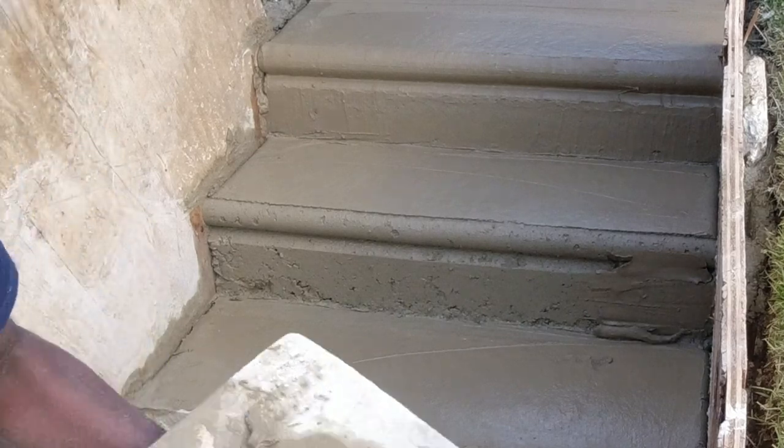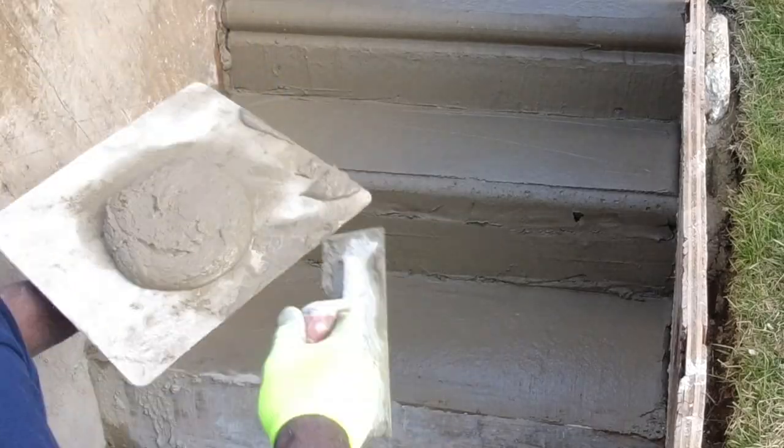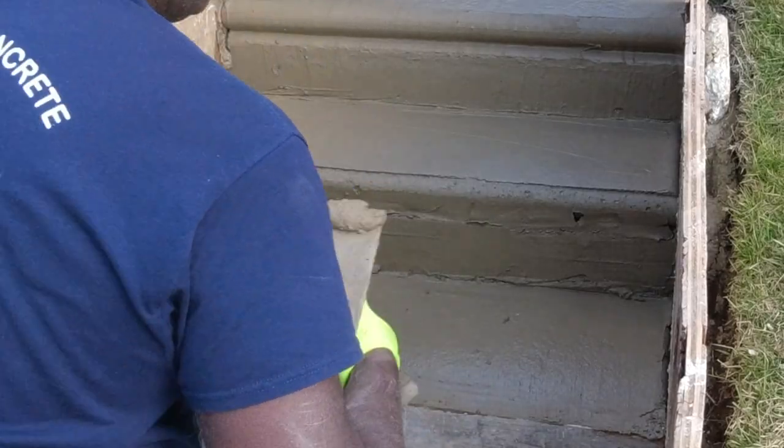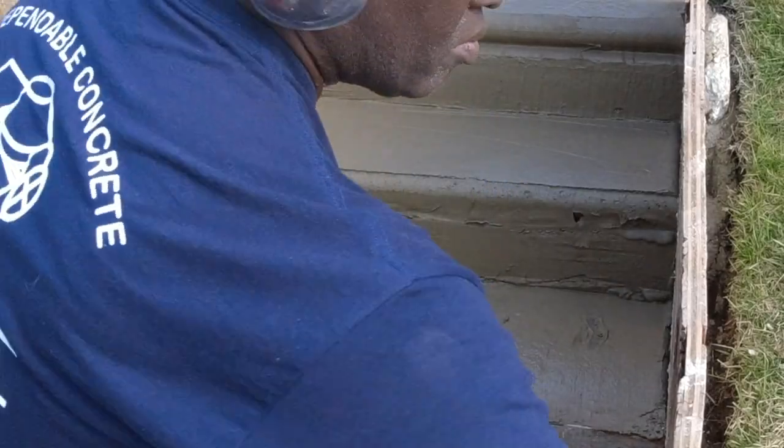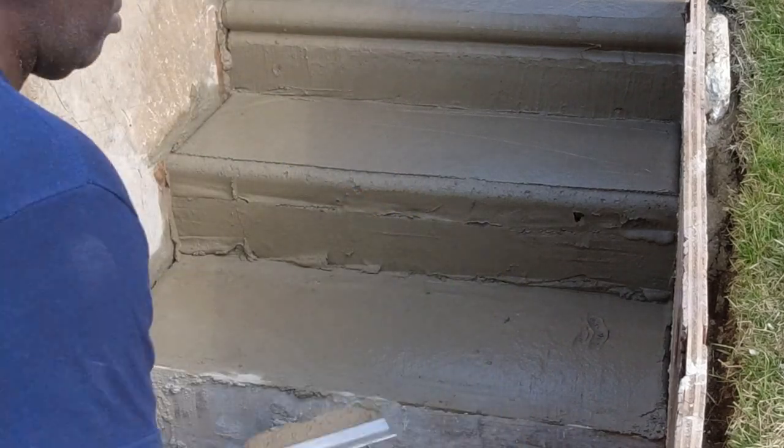During the finished stage, I apply a thin layer of cement, pressing it firmly into the concrete to create a strong bond. At the same time, I shape the bull nose edging of the concrete steps using cement, resulting in a smooth rounded finish.